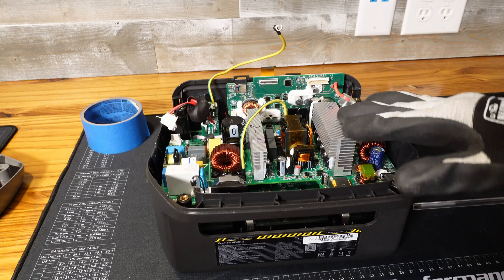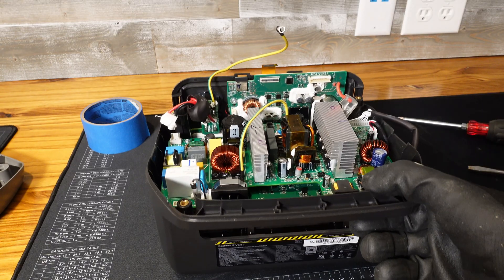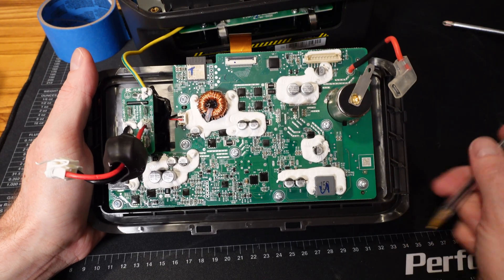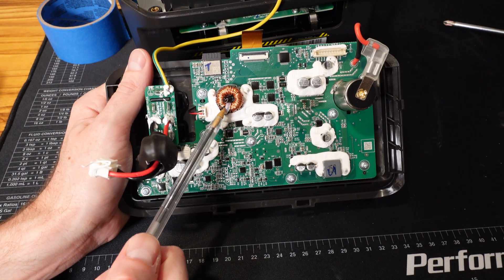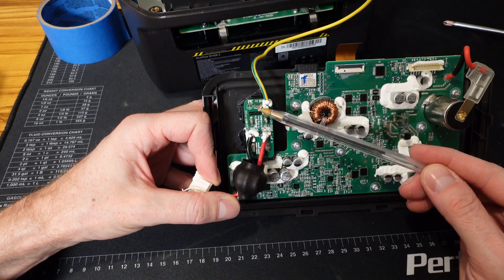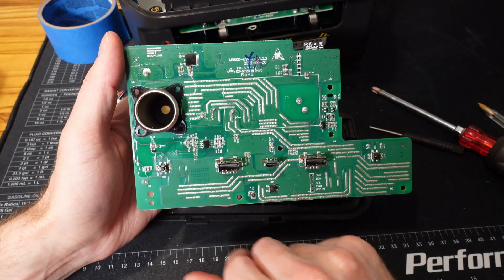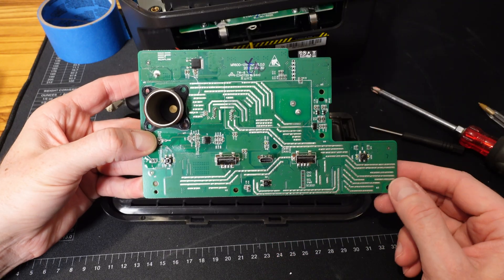This was discharged a few days ago, but I still don't know what voltage may be present on some of these capacitors, and I am not interested in getting shocked. So I'm going to use some insulative gloves and use caution while removing this. On the front panel board, these two knife terminals are where the DC power is coming in. We have an inductor, which I believe is part of the voltage regulating circuit for the USB ports. On the left we have the AC output — the ground conductor goes to the top receptacle, and the bottom receptacle is ungrounded, simply a line and neutral. This is the car accessory port, two USB-As, and a USB-C. There are some fairly heavy solder traces here, which is good to see.